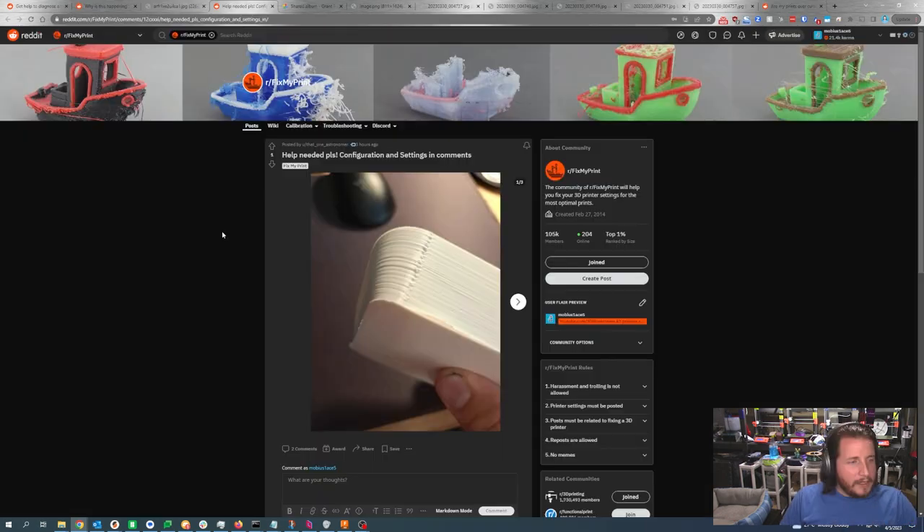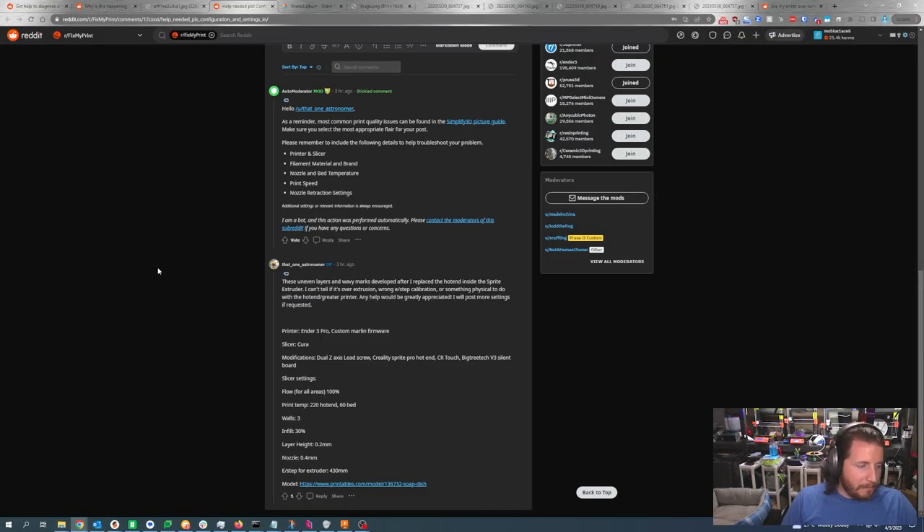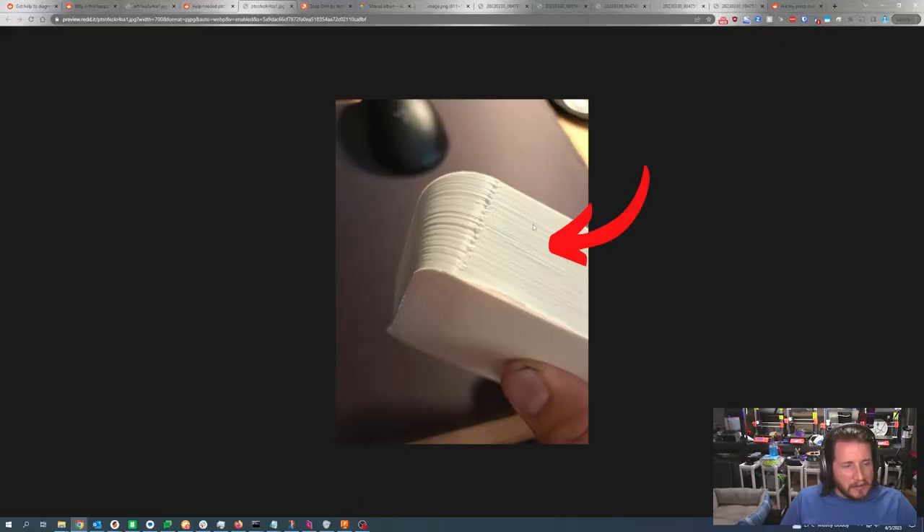Next: uneven layers and wavy marks developed after replacing the hotend inside the Sprite extruder. The sender, Kira, can't tell if it's over-extrusion, wrong e-step calibration, or something physical with the hotend. Settings: Ender 3 Pro with custom firmware, dual Z, Sprite hotend, BLTouch, BigTreeTech V3 silent board. Slice settings: flow at 100, print temp 220, bed 60, three walls, 30% infill, 0.2 layer height, 0.4 nozzle, e-step at 430. Looking at the model, this is going to be a retraction issue — pretty much a guarantee.